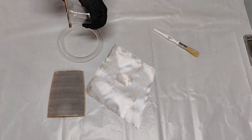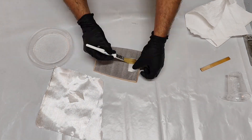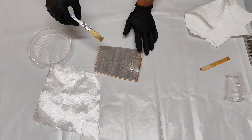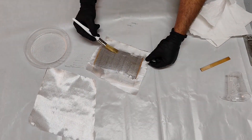I'm using epoxy resin with a 20% mix ratio for the layup. The hardener I use is the fast type. So after mixing the resin and hardener, I pour it into a large container. That way it can release heat more easily and won't heat up too fast, giving me more working time before the epoxy starts to cure.